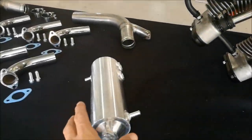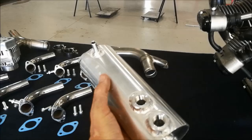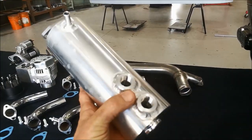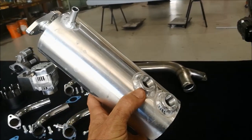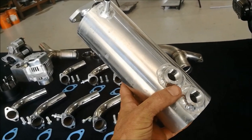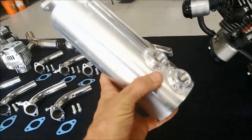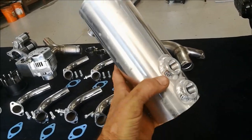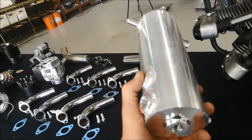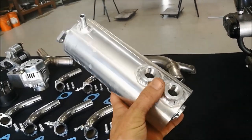Moving along, we have the mini sump — that's the sump between the two lower cylinders, you can see it right there. The next generation sump, which hasn't gone into production yet but will, has two convenient scavenge ports on the back. Customers who want to run an electric scavenge pump or a clean kit no longer have to tee or use intersections — they can simply use the second fitting. You can put the engine scavenge pump and the electric scavenge pump on either port; it would make very little difference.